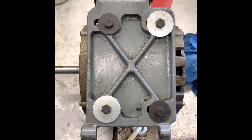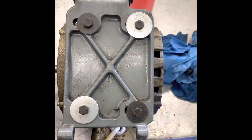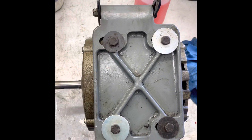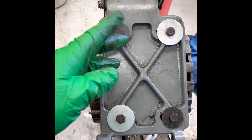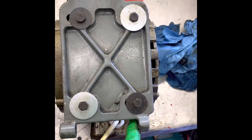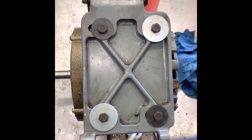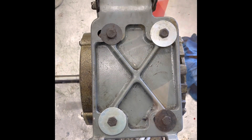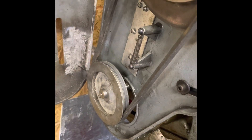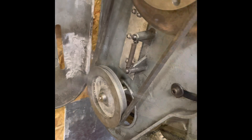Get it on the Myford, get set up, put the pulley on and get that centered, lock it all down nice and tight. Mounting pins through there on the machine, little grub screws to lock them in place. Motor's in, all fastened on — give it a spin up in a minute.